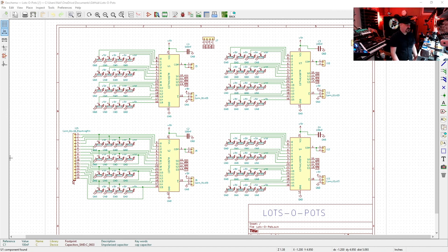Here is the circuit I'm going to use for this video — a new project I'm working on. It's basically a circuit board with 64 potentiometers hooked up to four 74HC4067 multiplexers. This is going to allow me to have all these pots ready to go so when I'm testing new circuits I don't have to wire them all up on a breadboard. I just have to do this once and I'll have a test bed that makes my life a lot easier.